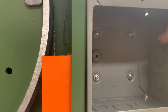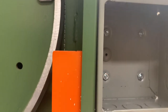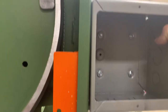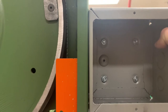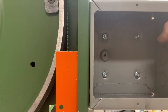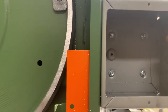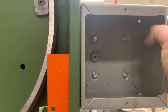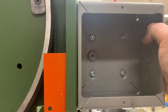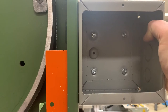There's a little bit of space to the right of the wheel where there's the weld that holds the wrap-around of the top head against the back plate. I can pull this orange blade guard off, so I'm going to measure over and drill two holes just to the left of the seam between the edge and the back plate. I think there'll be enough overhang on the metal mounting bracket to get a good solid mount with only two bolts, and those will be out of the way of the operation of the saw.